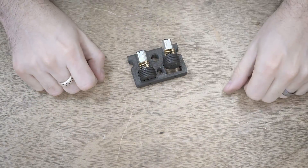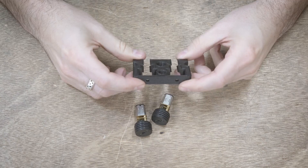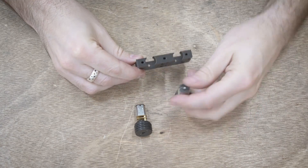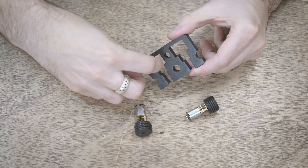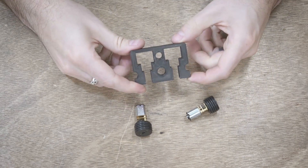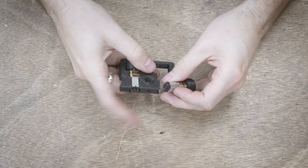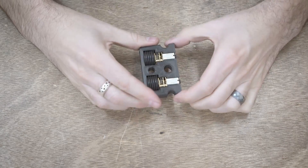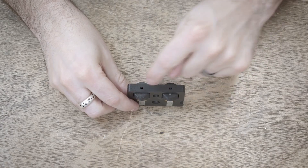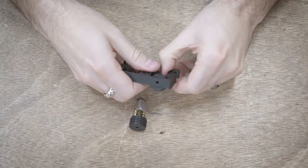Now I can take the motors and put them into the little motor frame. This frame is also Nylon X — I really like it because it prints well, is very strong, and remains a little bit flexible. That flexibility is key: the motor radius is matched inside, and where the wheels go it's radiused as well. To put the motor in you flex the frame out a little bit, spin it, and it snaps in. Now the motors are inside the cartridge — next step is to tap the holes.